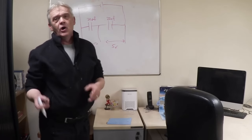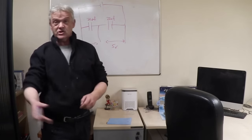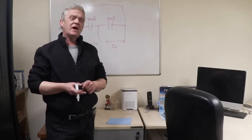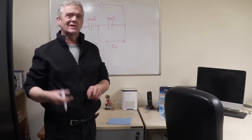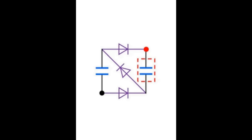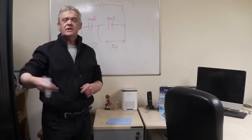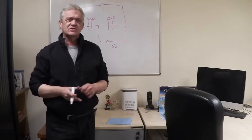It's pretty easy to do that. All we have to do is take those two capacitors and connect them up in a switch network. Mechanical switches are a bit of a pain, and we don't need to use them — we can put some diodes in. If we arrange the diodes into a little network, we will achieve that effect where the input voltage is divided by two, as long as the capacitors have the same value.